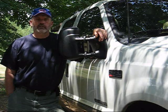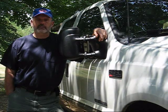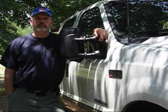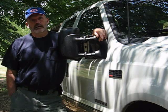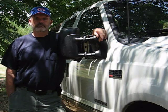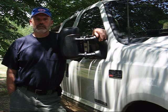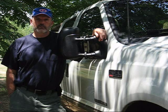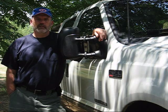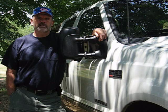I drained out the electrolyte, took it inside on the stove, let the battery charge for a while, and heated the electrolyte to 150 degrees F, which is about 66 degrees C. Brought it back out, poured it in the reservoir, and started the thing back up. By the time I worked the air out of the electrolyzer it had dropped down to around 55 degrees C. I then started adding more electrolyte — starting at 2 teaspoons of sodium hydroxide per gallon, I increased that to 8 teaspoons per gallon gradually. The temperature slowly rose to about 57 degrees C.